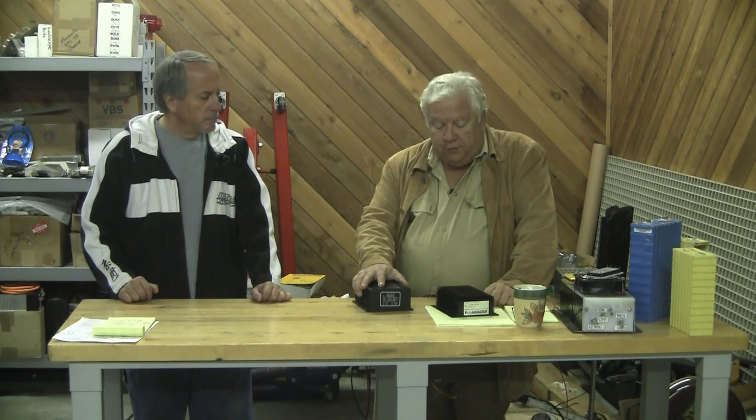I've got two here that I like, and the good news is they're cheap. I've been looking for a year, and sometimes you're just looking in the wrong place. These are pretty low output devices. The SurePower is rated at 30 amps output at 13.5 volts, and this is the Kelly HZ1 series, rated at 13.5 volts and 25 amps. Now that sounds a little low. Most cars have a 75 to 90 amp alternator, and a battery that'll put out 800 to 900 cranking amps. But we're not going to crank anything — we don't have a big engine to start, we just need to run the radio and headlights. Though it can add up — I think these 25 to 30 amp units are not quite enough to really run a Mini Cooper or something.